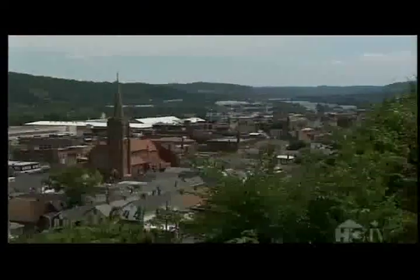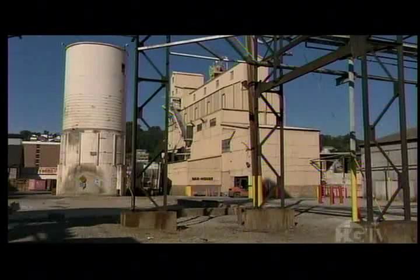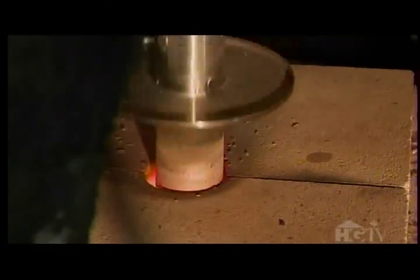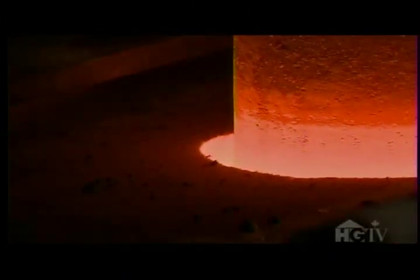Here in Charleroi, Pennsylvania, it starts in the mix house, where they carefully weigh out the ingredients. Sand is by far the biggest component, providing the silica needed to make glass. Other ingredients include limestone and soda ash. By far the hardest part is heating and breaking apart the silica — it's a very hard structure. Dealing with those temperatures is the hardest part of melting the glass; we get up to about 1,350 degrees Celsius and gradually raise that temperature throughout the furnace to melt all the raw materials.